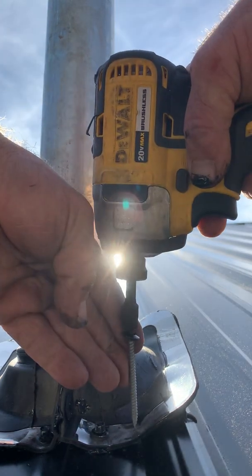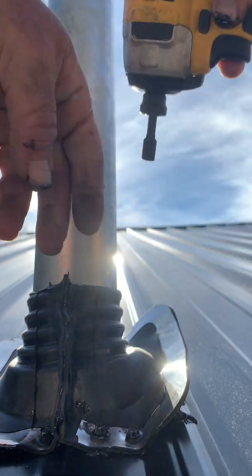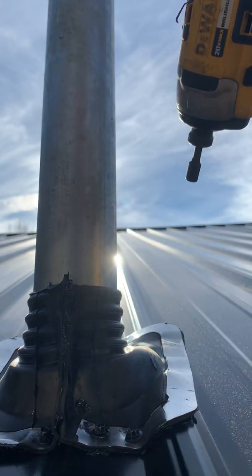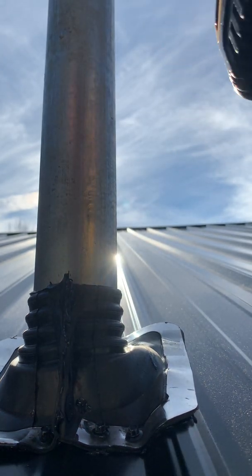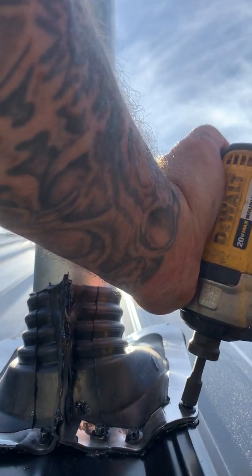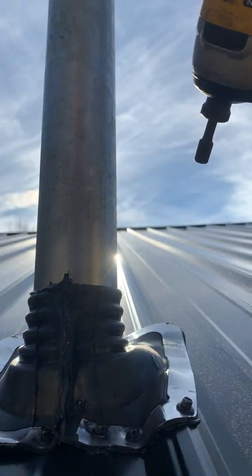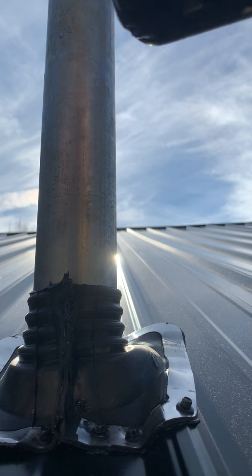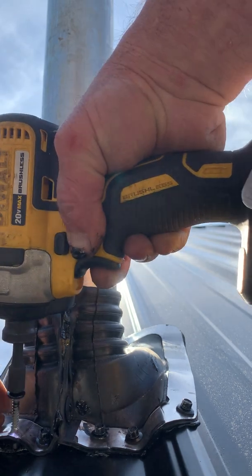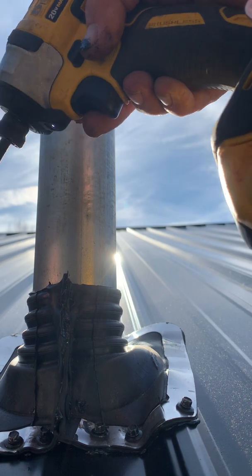This screw will go right here closest to the ridge. See how that rolls just like that? I can take one and put right here, and we can call it a day on that. I've seen people walk them up the ridges. It's just totally unnecessary. Nice little bead of solar seal pop out there. We'll walk this to the corner here. Specs say every 1/2 inch. I get good results out of 3/4 or thereabouts.